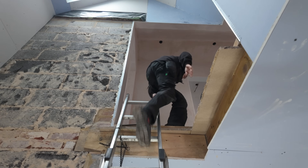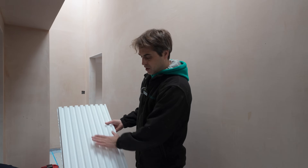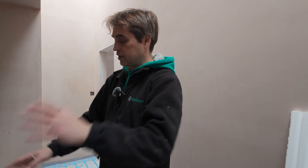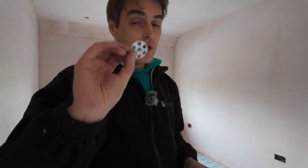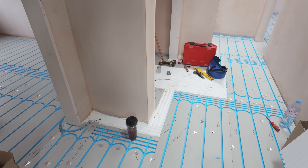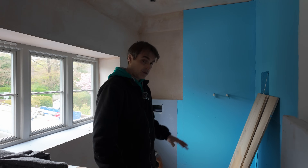Upstairs this is where the work's happening today. We are installing overlay panels at 20mm thickness, overall thickness of 21mm, which will take 16mm pipework. Those are our transition panels — just polystyrene — so we can route loads of pipes where the manifold is going. How we install those panels: we put them down, then use large washers — you can buy them in tile shops — and 38mm drywall screws to fix them down. There's 18mm ply plus 21mm panels, so we know those screws are not penetrating the subfloor. For bathrooms, the panels should be glued down on flexible tile adhesive, and that's what we've done here — flexible tile adhesive on the panels and also washers and screws.